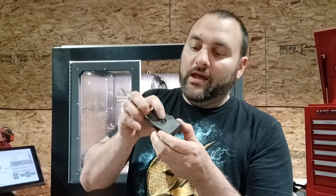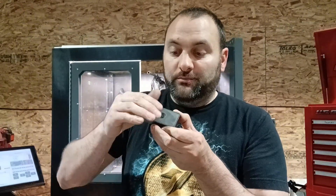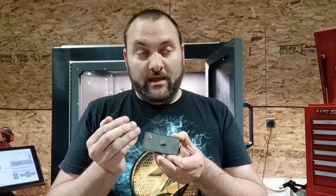The problem I had was a couple of things. First of all, RPMs maybe a little bit higher than they should have been — you can back that down. Also, if the bottom of your end mill doesn't finish below your part, the dull part of your end mill is going to be what finishes the hole and you're going to start to see a little bit of a taper.